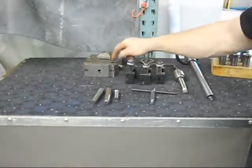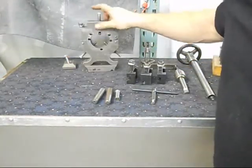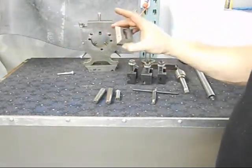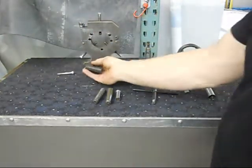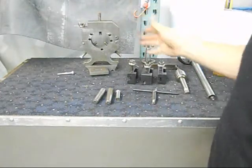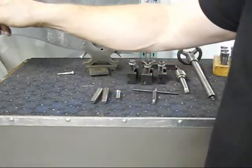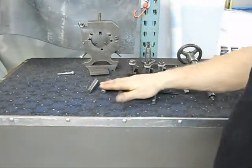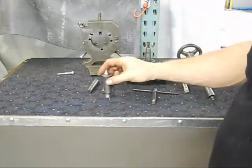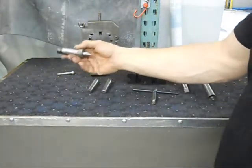There's what amounts to a homemade steady rest, and it's actually really well built. It's got a bolt that goes through it, and this looks like an original South Bend under-way lug for holding the steady rest down. There's one live center in the tailstock and two dead centers — one will fit right in the half-inch collet so you can use it as the dead center for the headstock for between-center turning.